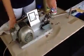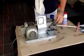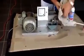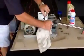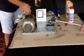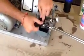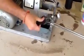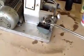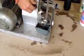Alright, the next thing I'm going to do is move this bearing into fresh metal again. And I'm going to clean this bearing with emery paper, the water paper. It's the only thing that will get the Uniglide off, you've got to machine it off, as I mentioned previously. So let's just clean this off. I'm now going to run dry bearings, no oil at all, to demonstrate how Uniglide will work once we've treated it.